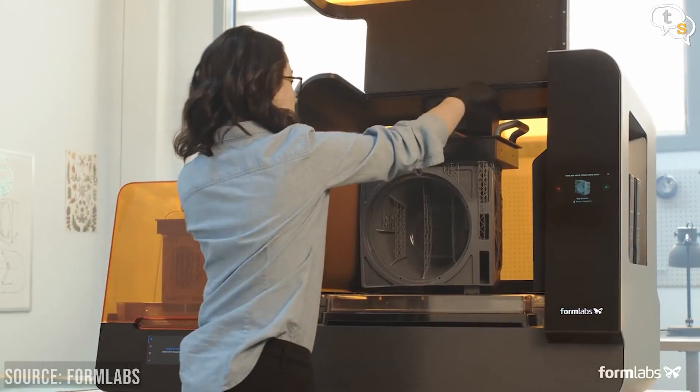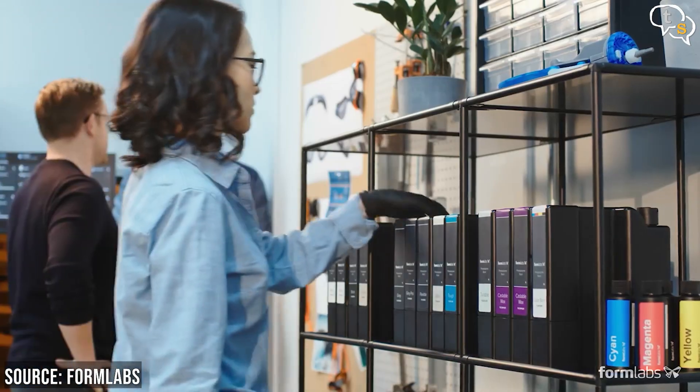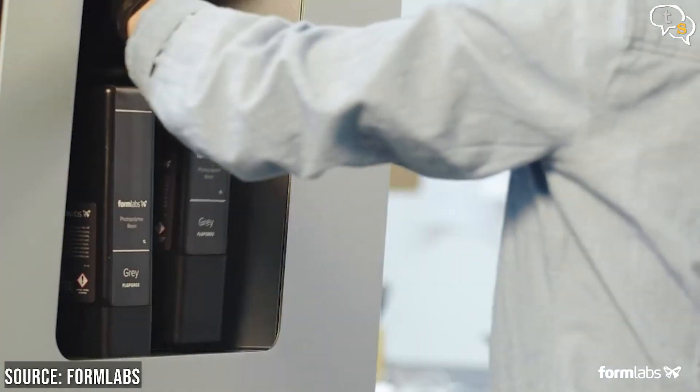SLA is the most precise 3D printing technique and can create extremely high quality details. But using a laser to print cross sections makes it take a long time. The resin prints are also fragile and not suitable as functional prototypes. If you need high precision prints with a smooth finish, SLA is the best, but the costs of materials and printers make it out of reach for many. DLP brings some of SLA's precision but has similar material handling problems, as the resins can be toxic.